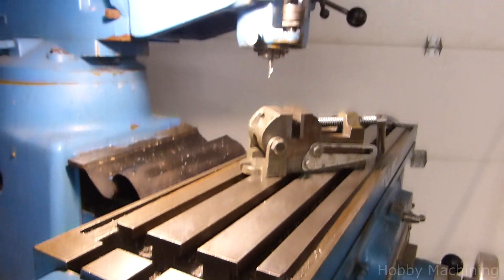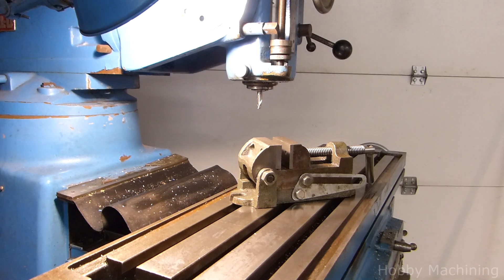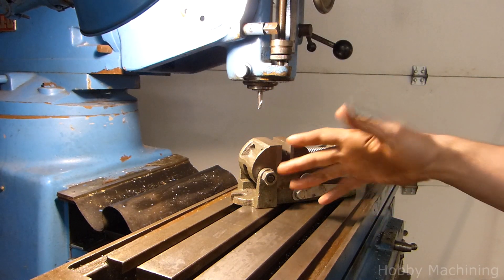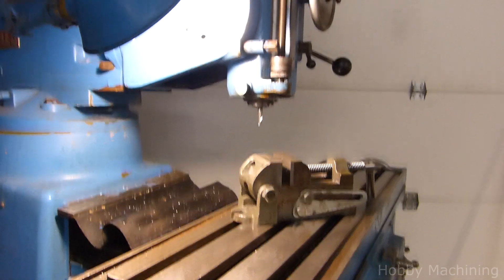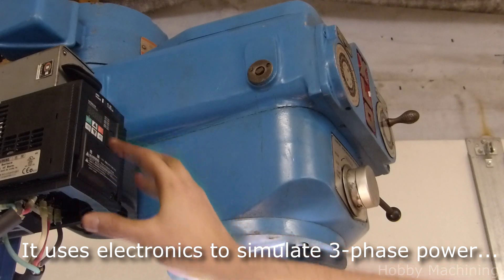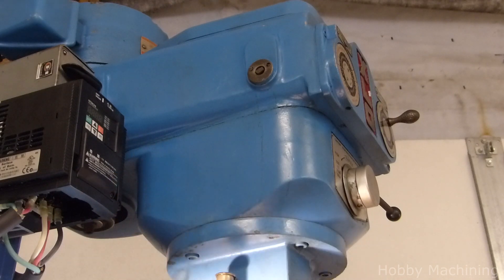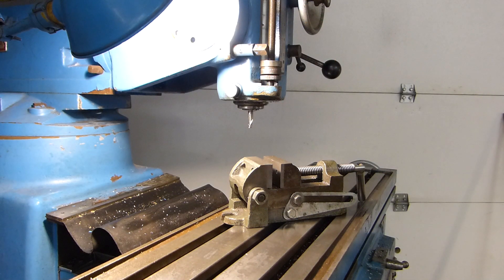Here we are — life is good. I've got a giant mill in my shop; what else could a person want? Everything seems to work well. I gave it a test drive, I trammed it and I've got it within 5-10 thousandths of an inch, which I feel is great, and everything seems fully operational. This VFD is absolutely fantastic — I'm really excited about programming it some more. I'm going to put a panel with some buttons for forward, reverse, jog, and a couple other goodies up there, as other people have done. Check out my other videos for more information on the Excello mills and to follow along with me on some of my other projects. Thanks for watching.